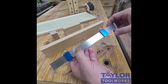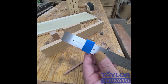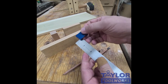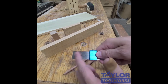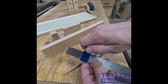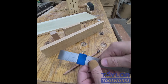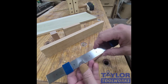These little things give this ruler superpowers and allow it to do repetitive measurements. They're called ruler stops — simply a little piece of extruded aluminum with a brass knob. You can slide them onto the ruler, lock them down at any measurement, and use that distance for repetitive measurements. It doesn't take much pressure to lock — just tighten slightly and the stop won't move. The brass knob is softer than the stainless so it won't mark the edge of your board.